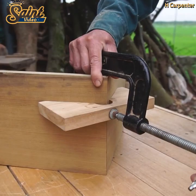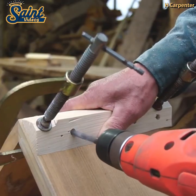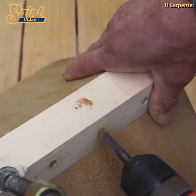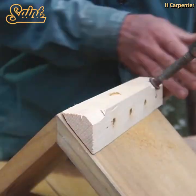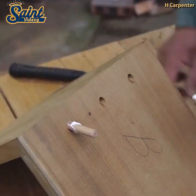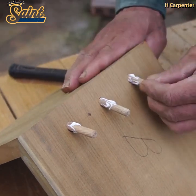Whether you are doing rough construction or fine finish work, the best all-around hammer is a smooth-faced 20-oz with a straight claw. I use the claw to pry under walls for lifting, to embed it in framing, and even to do extremely crude chiseling. Best of all, it's a better shape for pulling nails than the curved claw style.